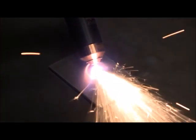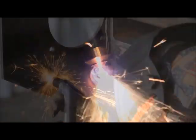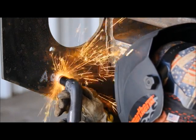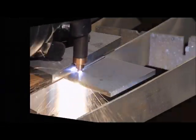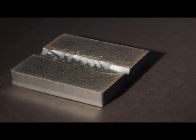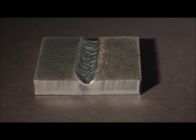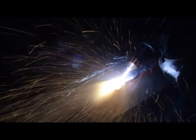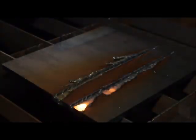This specialised part is ideal for applications where precise amounts of metal are to be removed, such as around spot welds, marking for part identification, score lines for bend or weld locations and creating dimples for drill starts. Cut and gouge quality, as well as consumable life, are very important factors for operators. Air quality, piercing technique, length of cut or gouge, operator skill, material thickness and material type all play a role in consumable life.